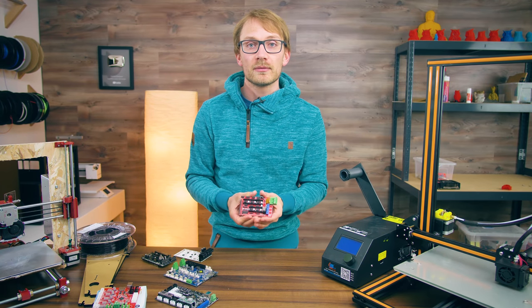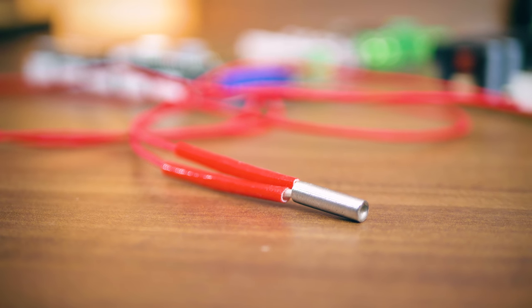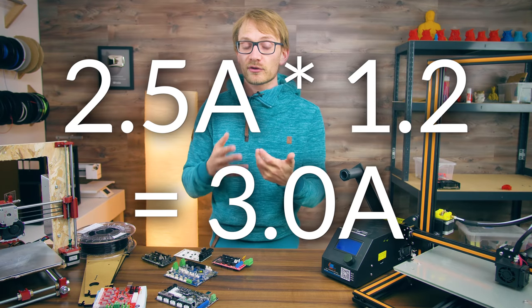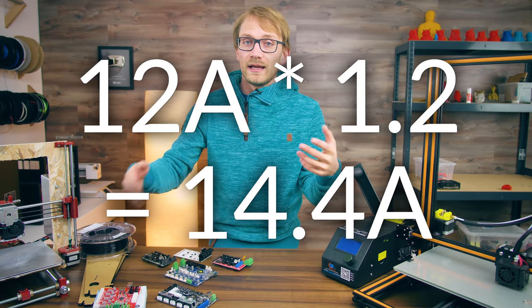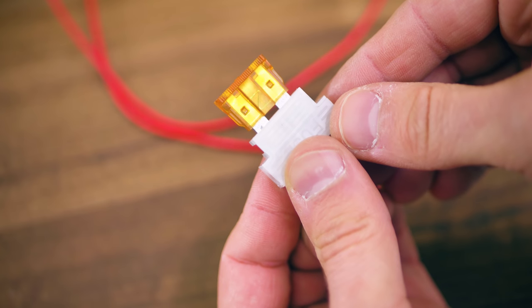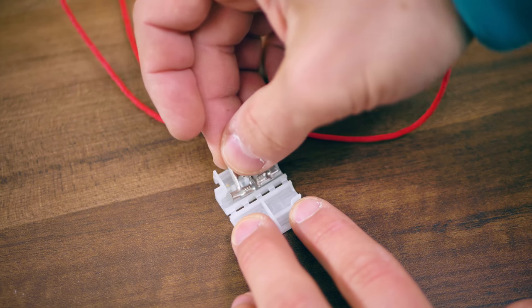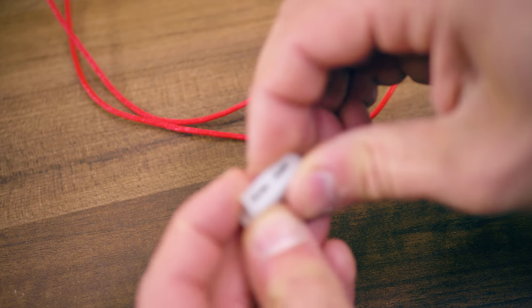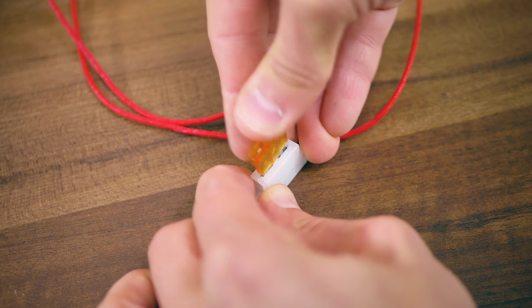As a rule of thumb, a good safe fuse level is at least 20% over the current you're expecting. So for a 12V 30W heater cartridge — the typical rating these days — that draws around 2.5A, a 3A fuse is really good and safe. And for a 12V heated bed, which is usually around 12A, a 15A fuse is a good choice. I like these automotive fuses and the appropriate holders for them — they're really cheap, definitely cheaper than replacing a burned-down printer. They're available everywhere and in all the current ratings you'd need, they work up to 32V, so either a 12V or a 24V 3D printer is going to be fine. Link in the description for these exact ones.